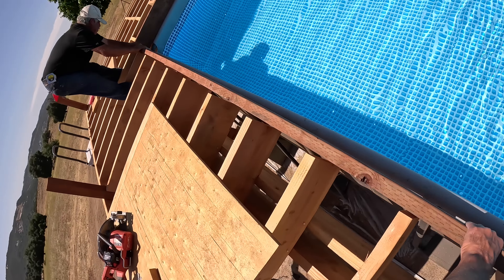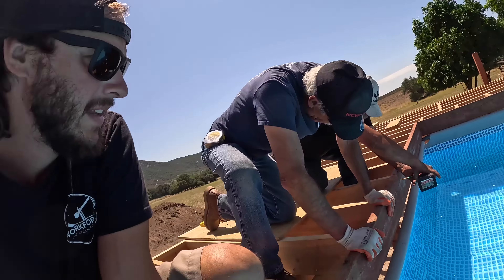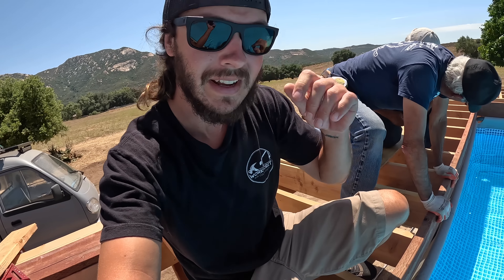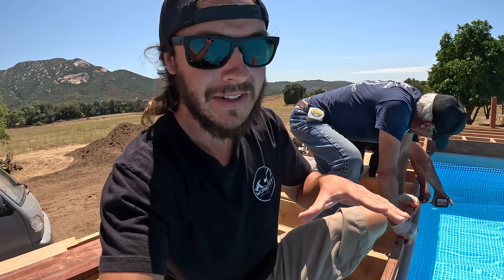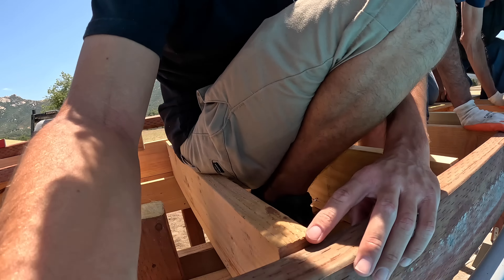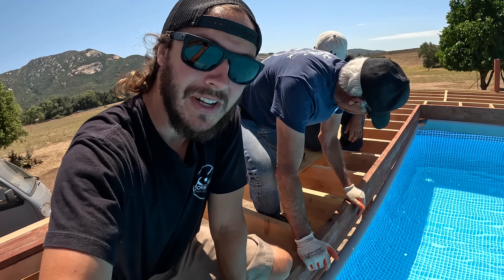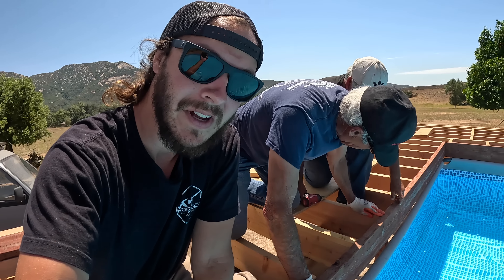We're going down the line re-straightening this board. What a lot of people do is put a screw on each end and then go down the middle — that's not how you get these boards straight. Start at one end, leave the other end loose. That loose end is basically your lever. If the board has some weird humps in it, you can get those out. Once he screws that, I can then bring this side back down. You'll see we're a little bit lower than this joist right now because that's where he needs to be in the middle. As we go down, we adjust using the long end as our lever — that's why we don't put a screw in it — and we can get them all to flush out at the top of those joists nicely.